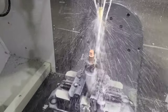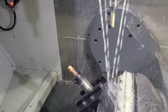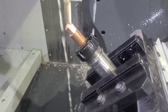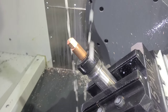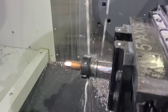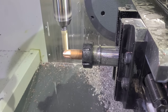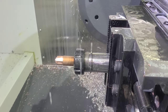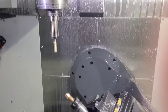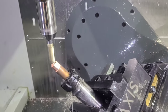All right, so there we have it all roughed in. Now it's going to come down and tilt it, and it's going to bring that same half-inch end mill over and make the first cut to cut one of the 26 different sides. Then it's going to bring it down to 90 degrees and make another cut. After this one, it's going to bring it back up on a 45, and then just keep rotating around and making the individual cuts to create all of those facets on the part.